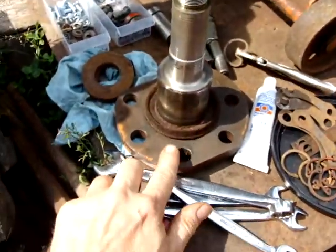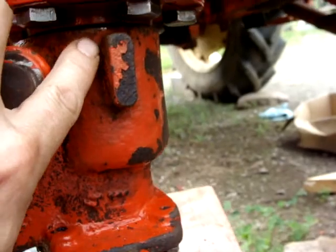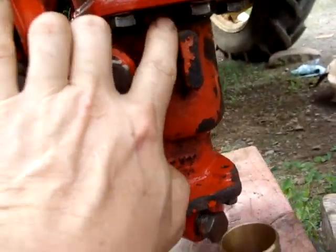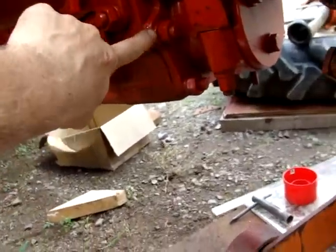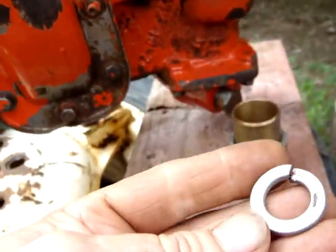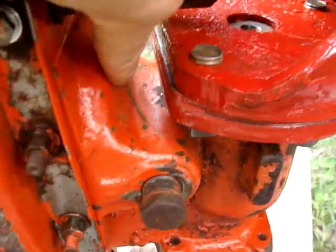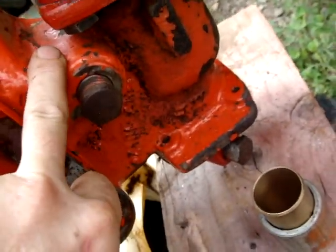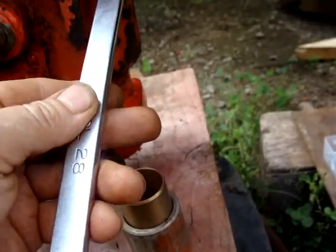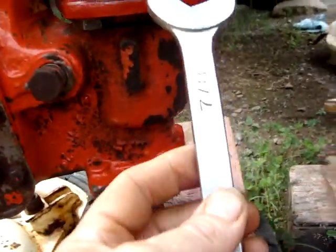This is the felt washer I was talking about in other videos — it goes right here. This piece of metal you bend over to hold these on. I foolishly bought new lock washers and put them in, and they were scratching. I put four bolts in and realized my problem — you've got to turn this, which is a problem because you can only use an open-end wrench. This happens to be seven-eighths. You can't get a socket in there.